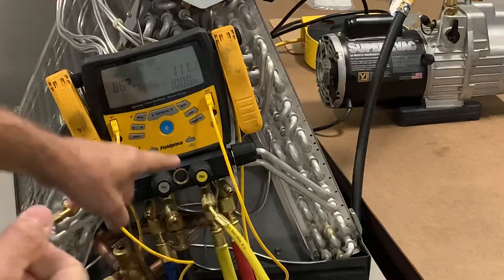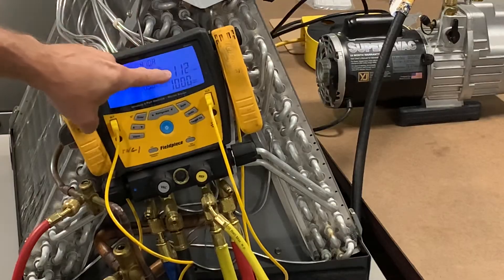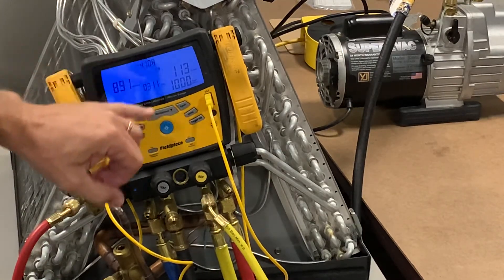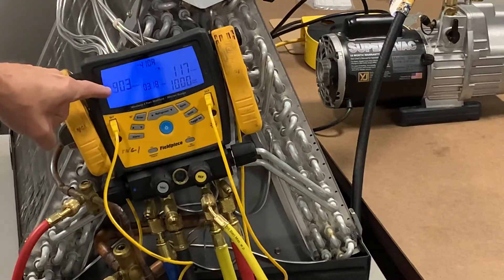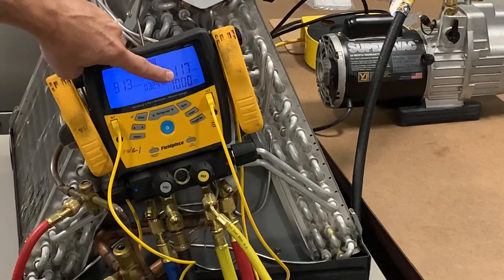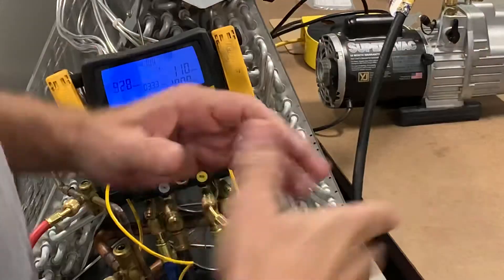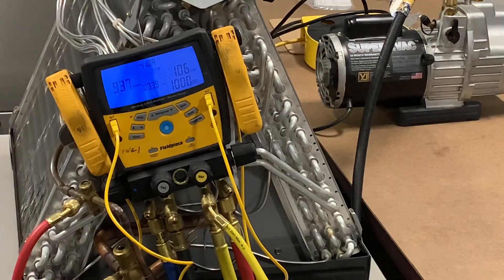There's a section right here showing microns per minute of leakage. I wait until about three minutes after I've shut things off and say: I have three minutes out of ten — seven minutes left, let's see if this will pass. Seven minutes times 117 — roughly 819, somewhere around 900. You take that and add it to the current reading. If that equals around 1,800 microns, that means you're going to be at 1,800 microns in ten minutes. You failed your test.